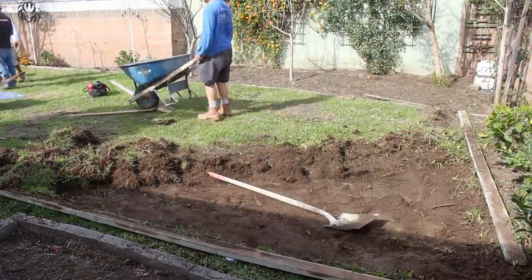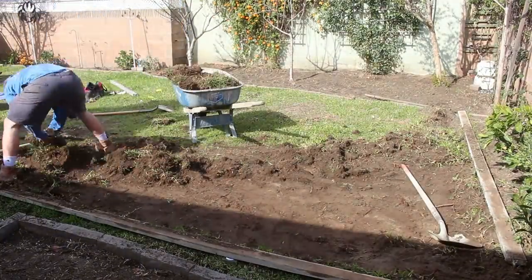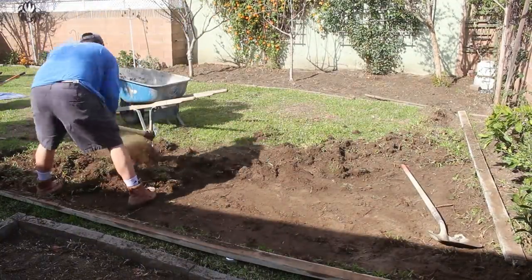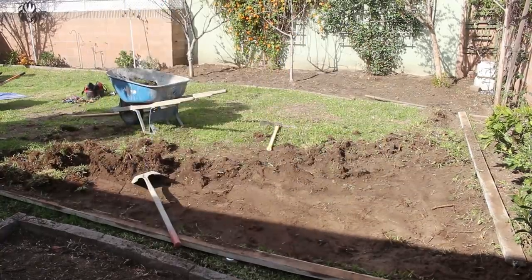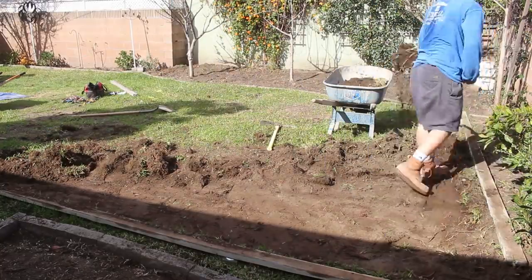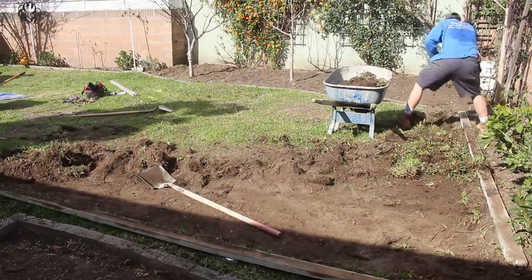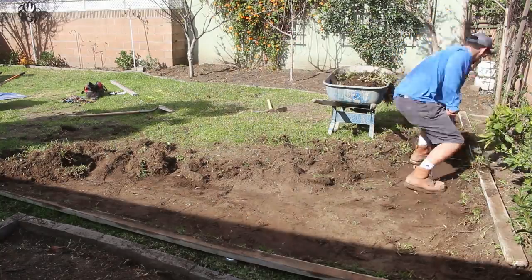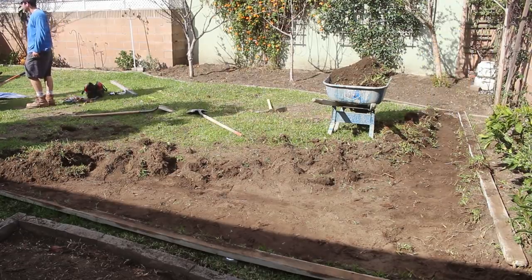And we do end up using the 3-4-5 method. We actually, it was a 6-8-10 method because this shed slab was about 12 by 12. Yeah, it was a 12 by 12 shed slab. So I ended up using the 6-8-10 method, which is an even more accurate method to square your concrete shed slab.